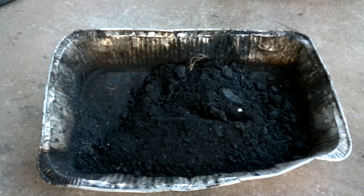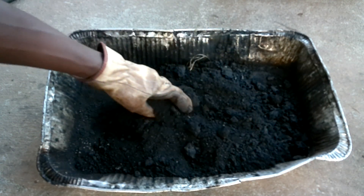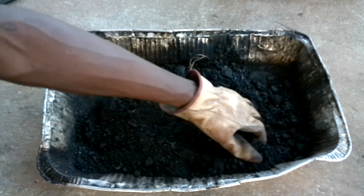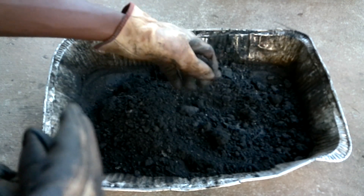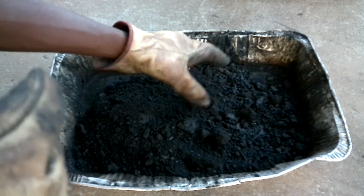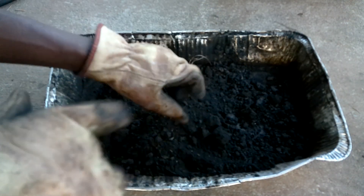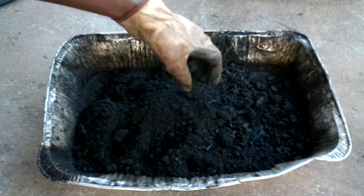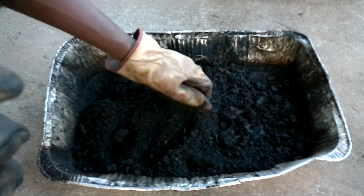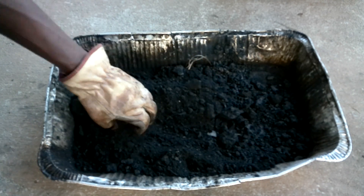Overall, here we have it — here's the carbon product. You can see nice carbonization, no real huge chunks, and really no visible plastic left. I will say, especially near the lid of the reactor, there were some bits that had some visible oil left in it. So I think for absolute carbonization we should have run it for another hour. However, this is still miles, light years better than the previous reactor — for just five hours to not even have any visible plastic.